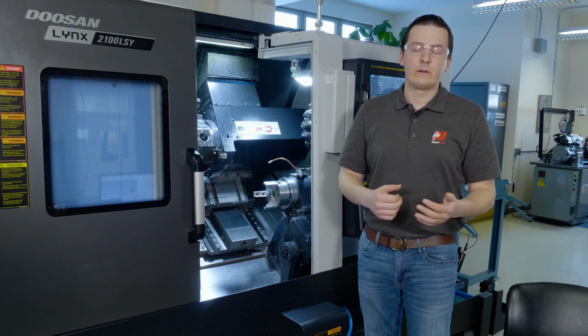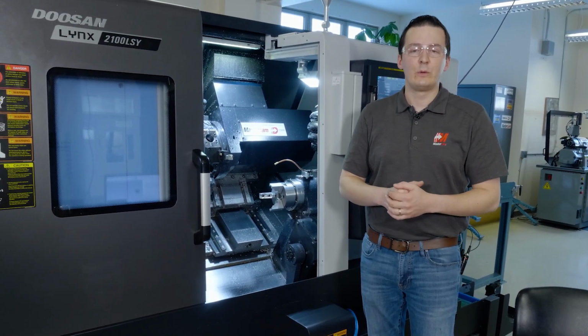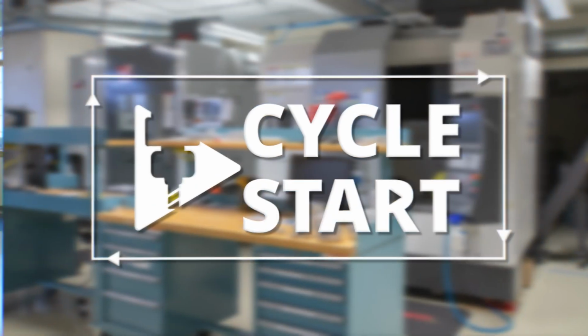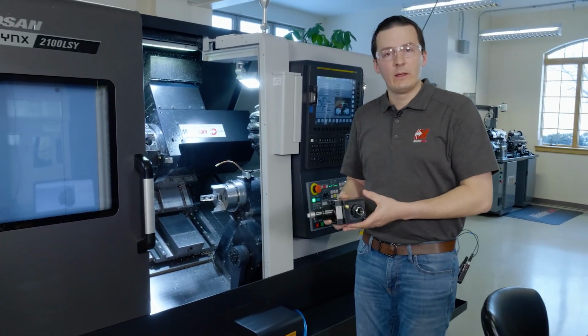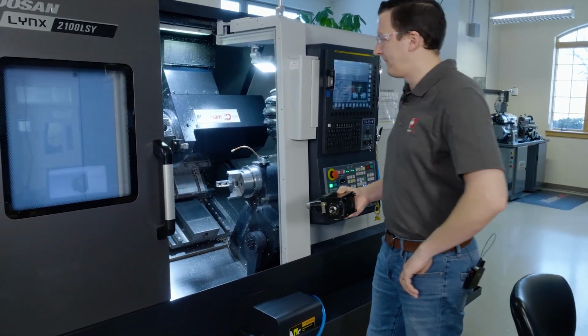The next step for us is to machine a hex on the face of the part. And in order to do that, we need to first install a new tool locator in the turret. I want to mill this hex with this new face milling tool holder that we have here. Obviously, before we can do any milling, we need to install this tool holder in our machine as well as in our Mastercam file.